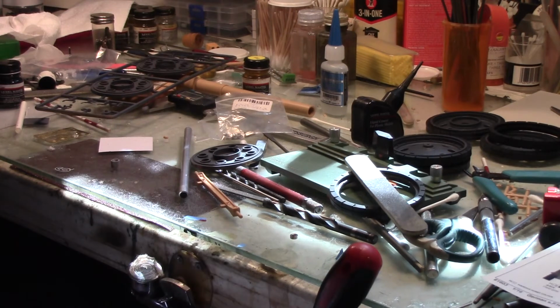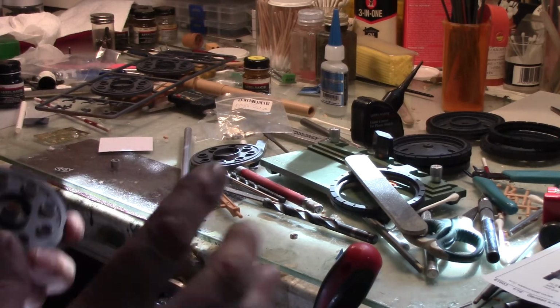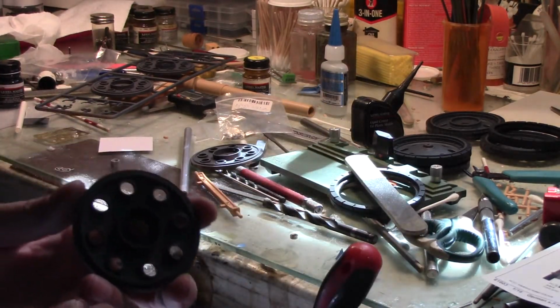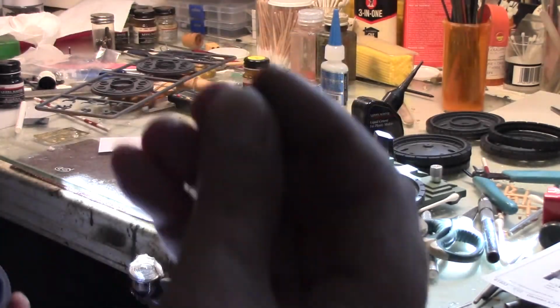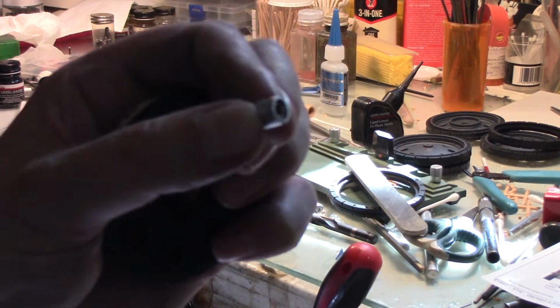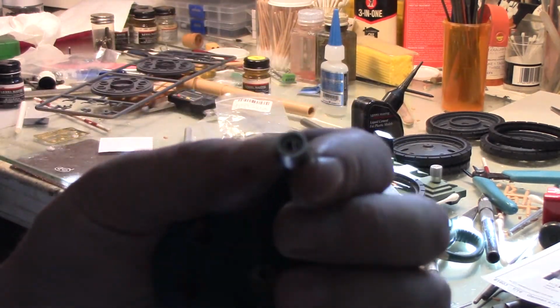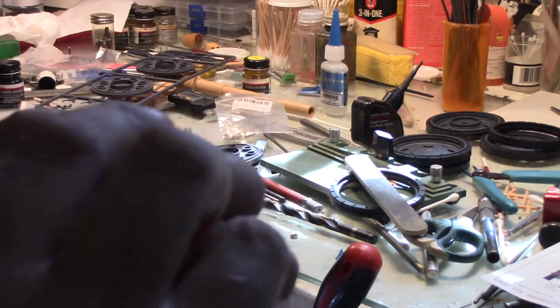I used a 15/64 drill bit and just did it holding the tube in a pair of vice grips, just did it by hand with a drill bit. I don't recommend that, though. It's very dangerous. You should put it in a vise to drill it out. So anyway, then I ended up with this. This is a little piece of the 5/16 tubing that's been drilled out to 6mm, and it's got two of those bearings already in there.